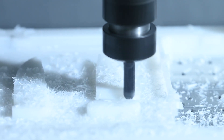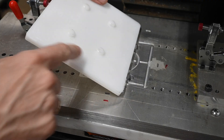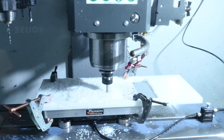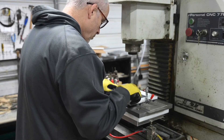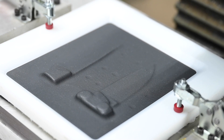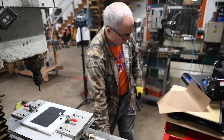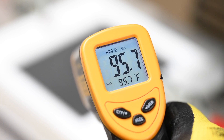I make a unique mold — or sometimes a couple of them depending on the type of sheath — with these little feet that fit repeatedly into these pockets, so once it's set it'll stick there. All this stuff was milled on my Haas. Once the Kydex is about 350 degrees, I'll flop it on the mold, put this frame on top, and then tighten it down with these toggle clamps. The pressure from the toggle clamps gives plenty of pressure to assure a good seal so you've pulled a good vacuum, and that gives you a good impression of the actual mold. Blast it with a little compressed air to cool it down, and once it's cool it's ready for step two.